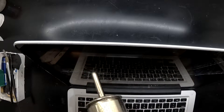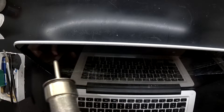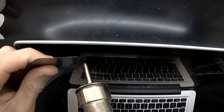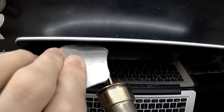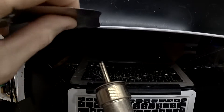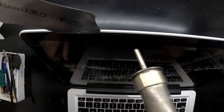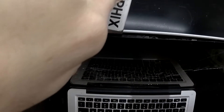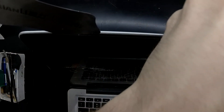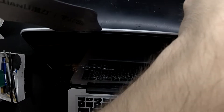During this repair I had the heat gun set to around 300 degrees Celsius, which was a bit overkill — some of the plastic did melt in a couple of locations and had to be trimmed and cleaned up. You could probably get away with anywhere between 100 to 150 degrees Celsius. Any more than that shouldn't really be necessary; the absolute limit I would use is about 200.